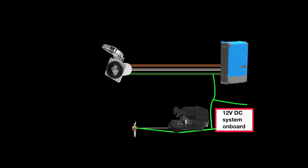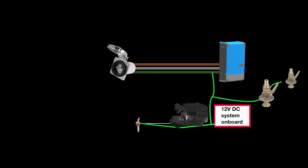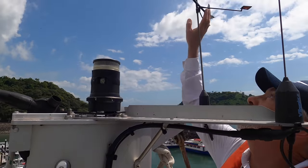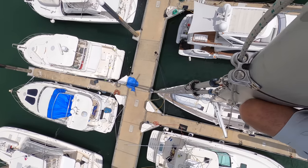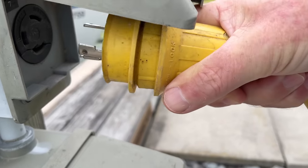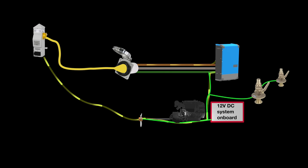The bonding system requires a ground to protect underwater metals from corrosion and is likely connected to a lightning protection system to direct lightning current down to the water as ground. This means there are two routes to ground for any stray electrical current when using shore power: the power cord to shore, and the ground to seawater. A loose connection in the ground wire — a faulty ground — combined with a ground fault can result in metal parts on the boat and underwater becoming energized.